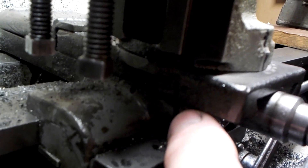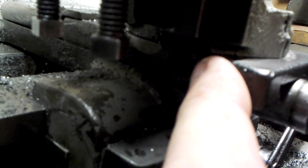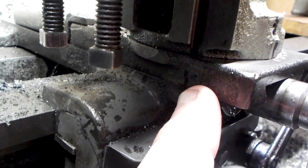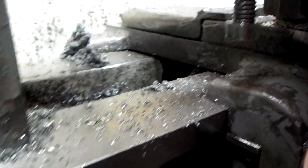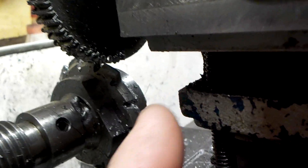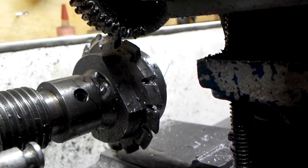I've got a couple of marks on the carriage — one there and one there — and I've got one mark on the cross slide in magic marker so they can be easily removed. Basically this is where I want the carriage to be stopped when it comes back so I can advance the indexing gear, and this is the furthest I want it to go in, because as it reaches that point there's not a lot of room between the milling attachment and the cutter.